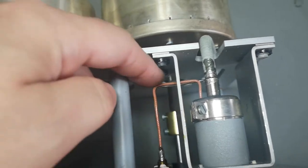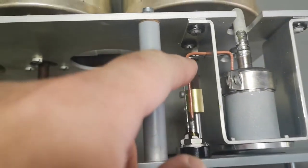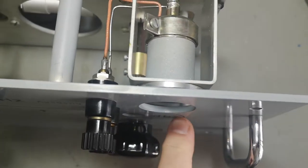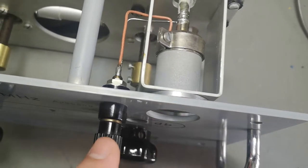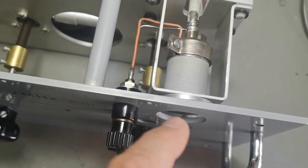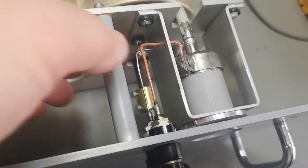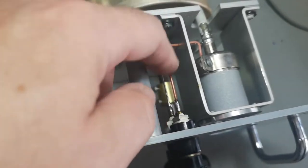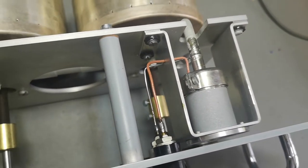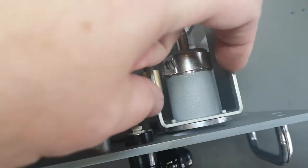This is the ground, so there's a ground wire all the way here to this banana plug, and the signal out is somehow connected via this tiny little hole into the center connector as well. If you want a banana plug connection, why not just stick the banana plug in here? This really doesn't make much sense, and it's not ideal for two megahertz. The impedance is of course 600 ohms — I'm not super impressed with this output connector.